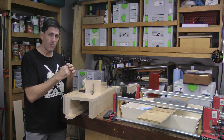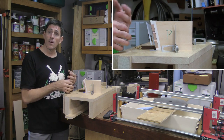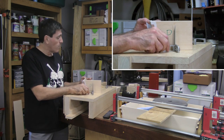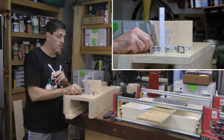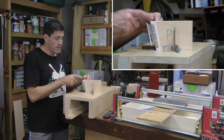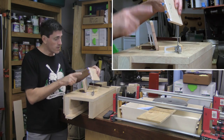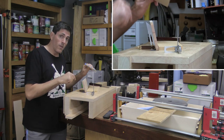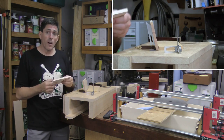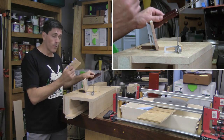You'll be able to see this visually with the projection in the other window. This is the compound angle I put together in the demo, which has both boards inclined — the tail board inclined and the pin board. The pin board has a soft inclination but it's still there. The miter angles we see on these boards, the ones that get cut, neither one of these angles is the angle on one of these bevel gauges. It's a function of the two combined, which is why we always had to use a third bevel gauge to steal angles and transfer them around during layout.